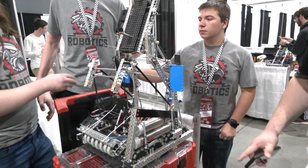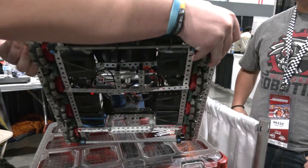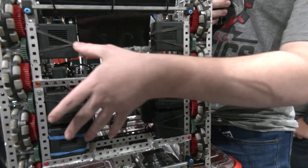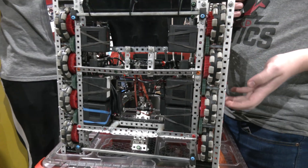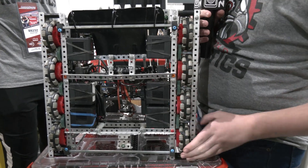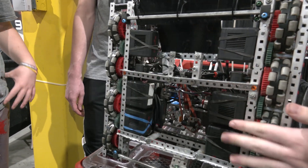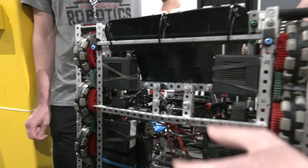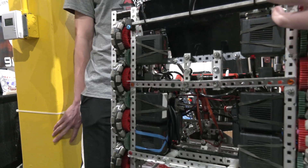Declan, let's talk about the base design — one of the few things you've kept consistent throughout. So on our base we have 77 watts of motors: three 11-watt motors on each side with a 5.5-watt above on each side. The 5.5s are locked at 200 RPM, so we gear that up to reach proper speed. Our main design detail that makes ours distinct is that our base has encoder wheels set into the base itself rather than on a separate mechanism, so we can reserve space and keep everything nice and compact and multi-purpose.